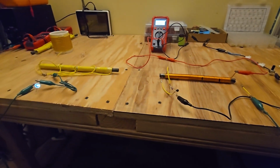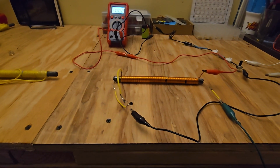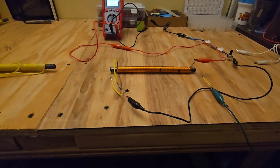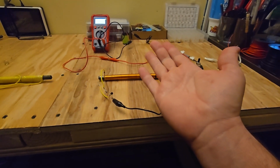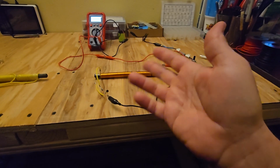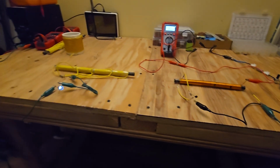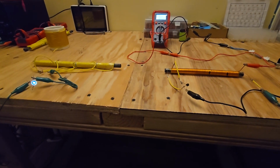And the more sensitive the transistor that can achieve zero voltage switching or zero current switching, we're in business. We're then just needing a potential voltage source to trigger the switching, but we don't consume current. Alright, anyway, so we're back. So back to the theory of how it's working.